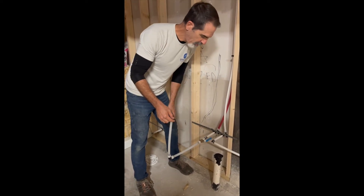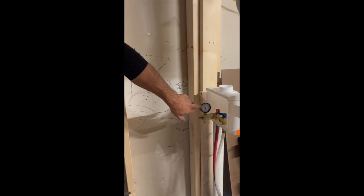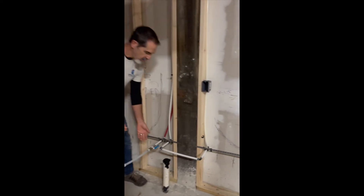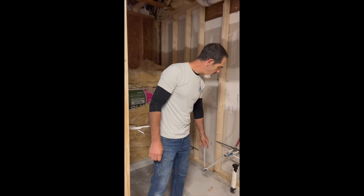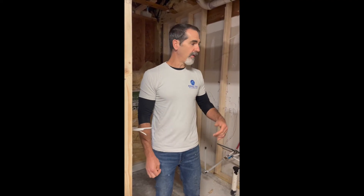It is now under pressure, and just to put a little extra stress on this to see how it's going to do, I went ahead and put the whole pressure test for this whole little system up to 100 psi. It's been sitting like that overnight. So to close the loop: this piece has been frozen, thawed, and hooked back up with a hundred pound pressure test on it. I'm not saying there are no conditions where this pipe will freeze and bust, but under these specific conditions — frozen for 10 hours, thawed, and put back on up to a hundred pound pressure test — it looks like it's done completely fine. Use this as a baseline for the conditions you're in, but under these specific conditions, looks like the pipe did great.